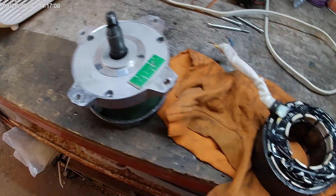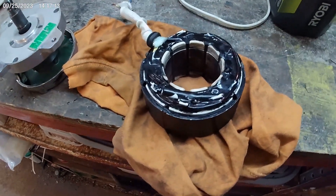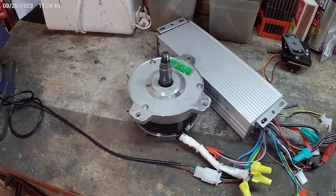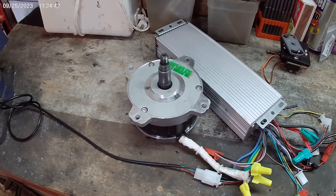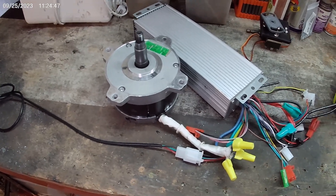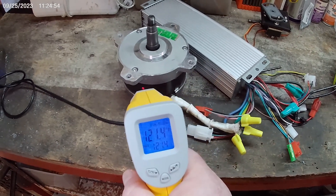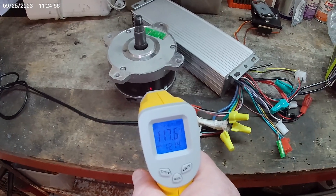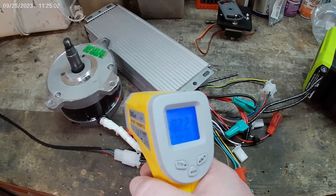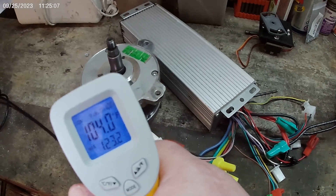If something happens to this motor after some time, I'll post another video explaining about it, and maybe if I figure out what it fails of, I'll know more. The motor is now set up and running with the new encapsulated windings and new bearings. I'm going to periodically bring out this laser thermometer and check the temperatures to see how it's doing. Hopefully this will stay more stable — the temperatures on it before fluctuated more.